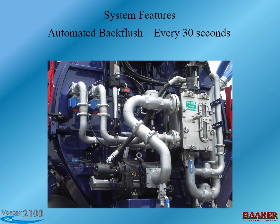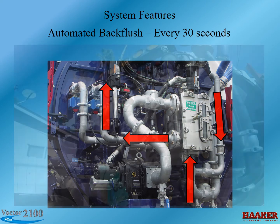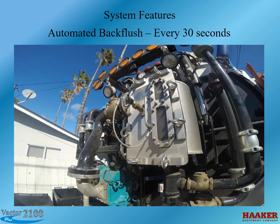In addition to the consistent removal of material from the filter housing, every 30 seconds the feed water pump is taken offline and the entire filter housing is evacuated. An air-operated ball valve opens to vacuum from the debris body, pulling material out of the bottom of the filter housing back to the body. A pipe open to atmosphere allows air to enter the center of the filter, pulling material off any of the holes in the filter. The ball valve then closes, and the feed water pump returns to normal operation and filtering continues. This all happens automatically when the recycle system is on — no actions are needed from the operator. The classification filter is continuously cleaned automatically; this video shows one of the automated back flush processes.